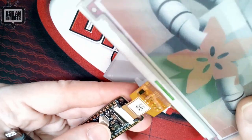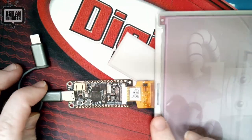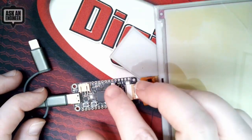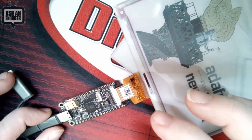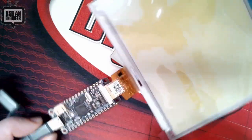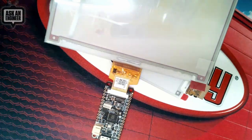The RP2040 is a great chip for e-ink displays because they need a lot of RAM — you have to draw the entire display at once. That's why we call it Think Ink: there's more than just an e-ink display that goes into this. You still get all the standard Feather pins, so you can connect your ink display — we have extension cables for this connector — and then plug Feather Wings on top. Want to add Wi-Fi, Ethernet, joystick, or TFT? Just plug in a Feather Wing. For most purposes, if you just need a board that runs any standard e-ink display with no soldering, this is plug and play.